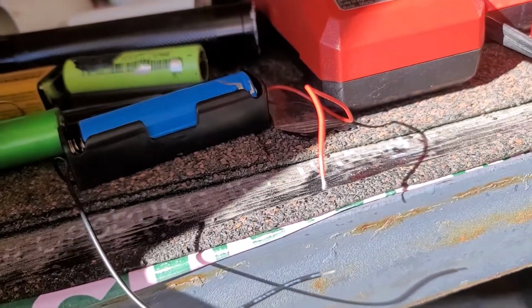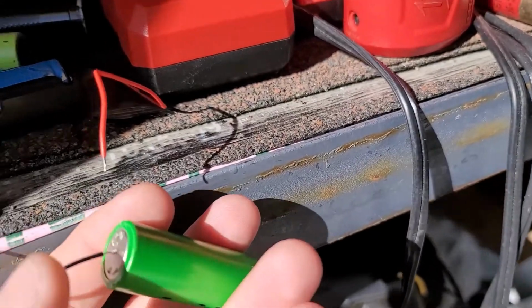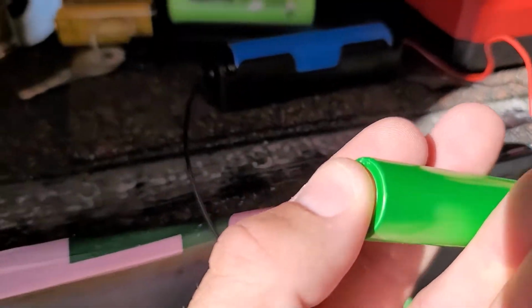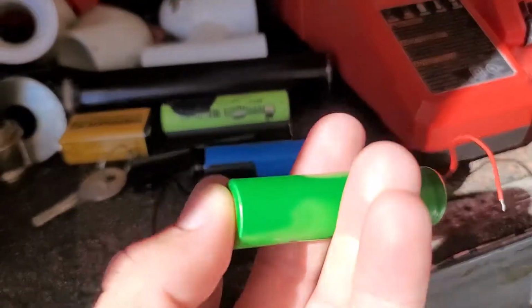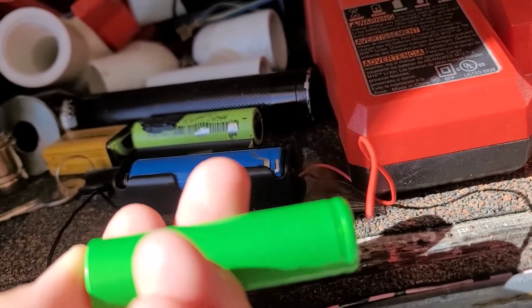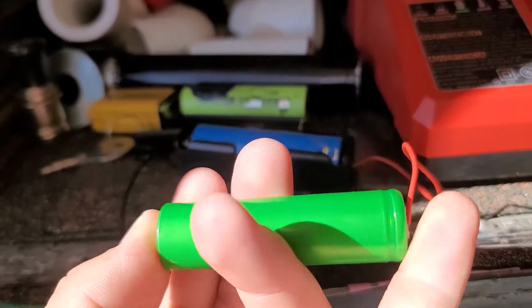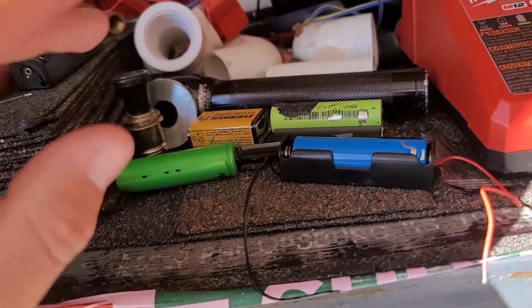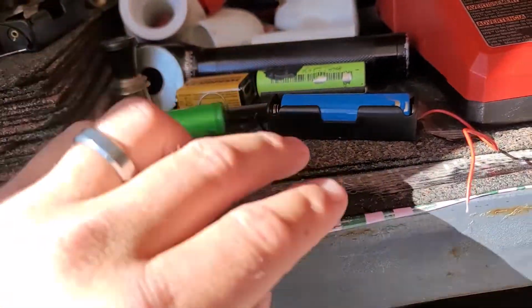and I took the cell that had 0 volts, and again, we'll try this one-handed. I would put the negative terminal here off of the charged cell that I had, and then I would take the positive and I would just touch these two together like that. I would do that for anywhere from 3 to 5 seconds, and then I would let it sit for at least 20-30 seconds or so.